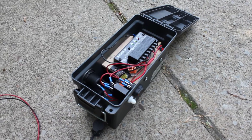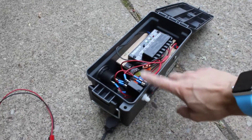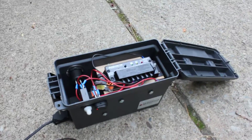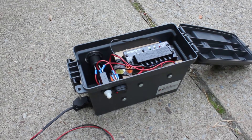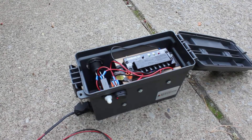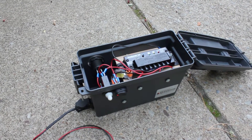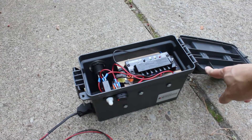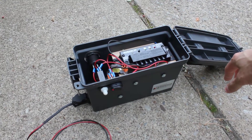I am working on a different setup — I've got a different ammo box, about the same size but more square. This one is actually tapered toward the bottom; I've got a square one from a different manufacturer, locally in Ohio. I'm switching to a lithium iron phosphate battery — much lighter — and an MPPT controller that supports the lithium iron phosphate requirements for constant voltage and constant current charging, versus traditional lead acid batteries which have different requirements. Stay tuned, I'm going to be working on that, hopefully in the next month or so.